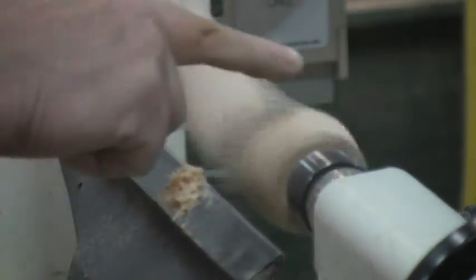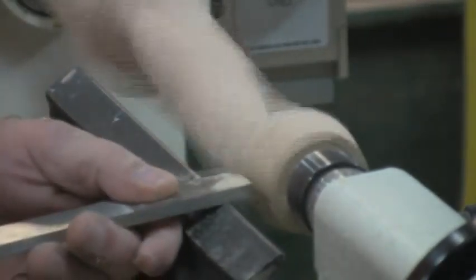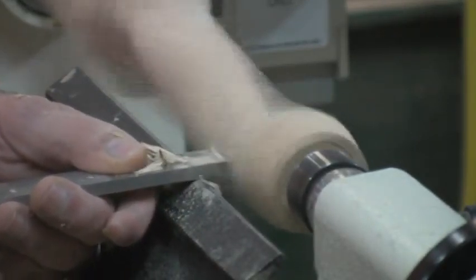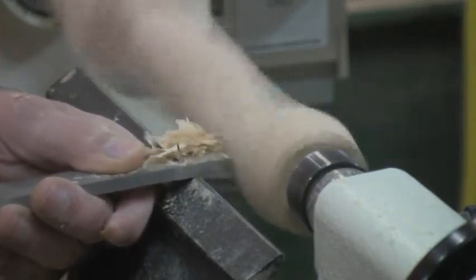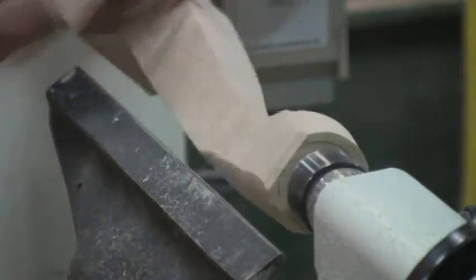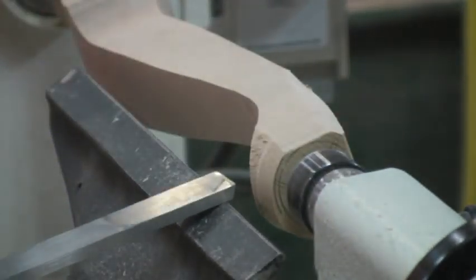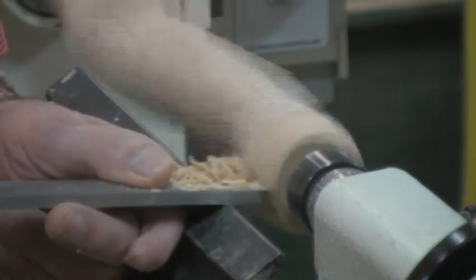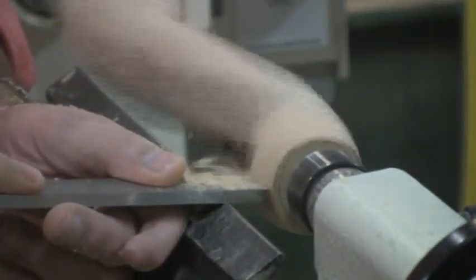Now, as I'm looking across the top, I can see my black magic marker. By just gently coming into this, I can actually round the back of the leg just a little. But go slow and go easy. See where it's taking that down? But you can see, even with a quarter inch back set, my foot is still pretty far forward.